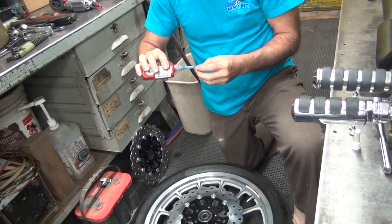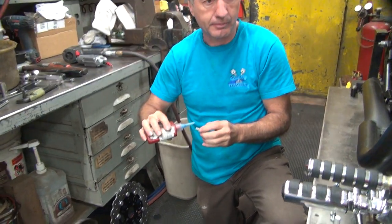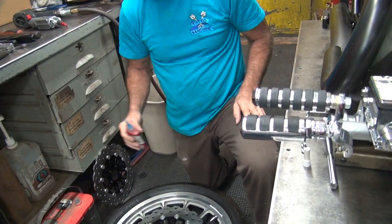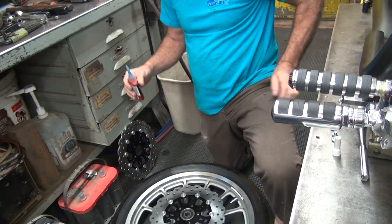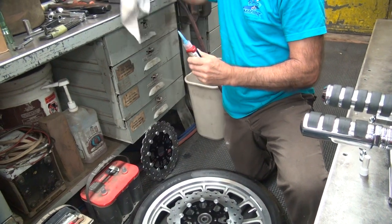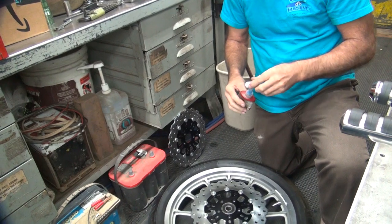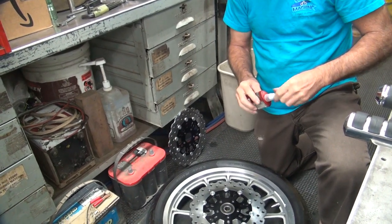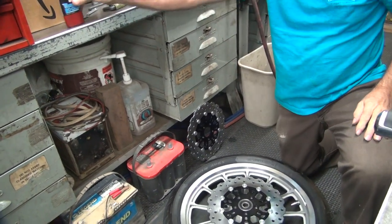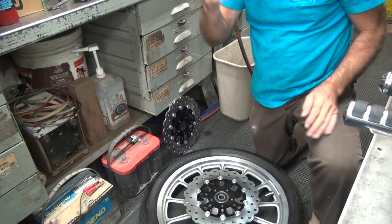What medium do you use in your thing? Do you have little glass beads in it? Your stuff comes out shiny — super clean white looking. Well, you got two levels of beads: AC which is coarse, and AG which is fine. I have both — depends on what I'm using. And then sand... I use 150 grit sand, which is real fine.